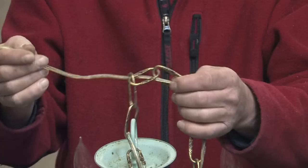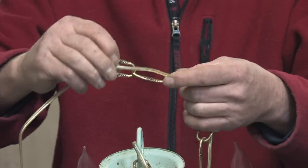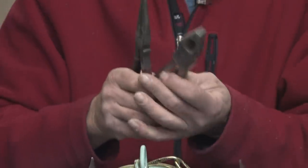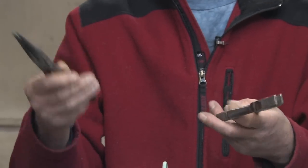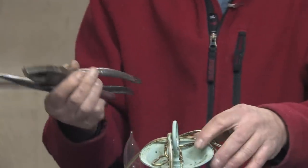It's going to require a couple different wiring techniques to rehang the chandelier depending on which type you have. But to shorten the chain, they're all the same. You're going to need a couple of tools. Most all the chandelier chains are lightweight in nature, so this can be done with two pairs of pliers. It doesn't matter if they're the same type — needle nose, lineman, standard pliers, channel locks — it really doesn't matter.